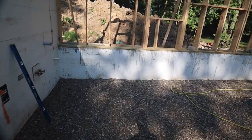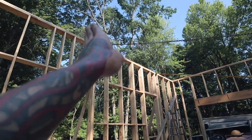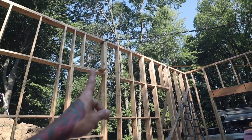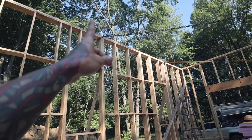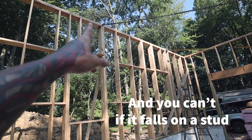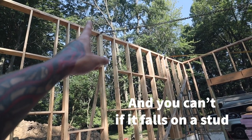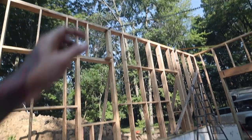The other thing I did is, I got to thinking, when you put roof trusses on, you don't really screw or nail up through the bottom of a double top plate and go into the truss, because no one's going to do a 3-inch nail plus another inch or two to hit that roof truss. So everyone usually toe nails. Now,